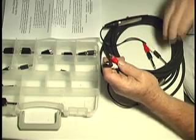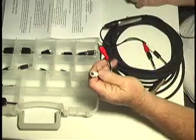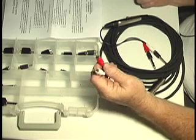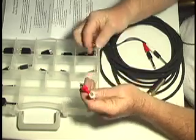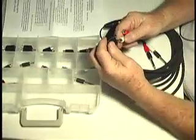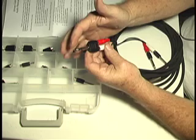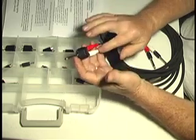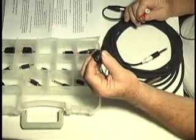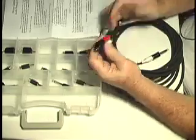And they carry, of course, a stereo signal through the cable. We have even run composite video on the white, doesn't really make any difference what color you use, and then mono audio on the red. We've done that. We've used it for earphone extension cords, and the way we did that was, at the time we were using a 1/4 inch stereo earphone jack or headphone output, and we plugged this jack into it, and it has a tip, ring, sleeve, stereo come through the cable, and then on the other end we put an adapter that looks like this, and it is an 1/8 inch female to 2 RCAs like that, and that gave us headphones.